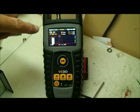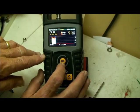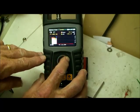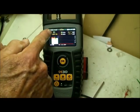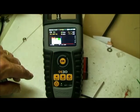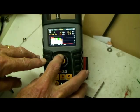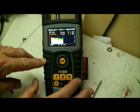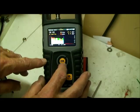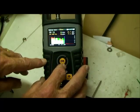If you can see it right there, there's a little gray spot. That is my marker, and that marker is in reference to the channel indicator that I have right up here. So if I rotate this, the marker is going to move along with my channel number. As I rotate this here, you can see that it went to channel 11, and it also indicates a new level there of 11.7 dBmV. If I go back down to channel 2, channel 2 was 13. That's pretty iffy, but it's okay. There's a little drop in the level, but they're not paying much attention to the analog in this location anymore.